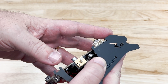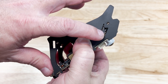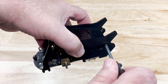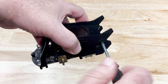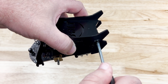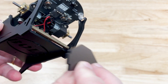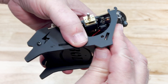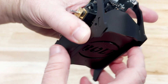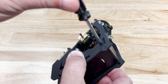Don't worry about the front yet. Do the same thing for the other side panel — again, just worry about that back tab, not the front. Attach the side panel only in the back with an M3 screw. Up next, we need to add the front plate. Make sure the tabs get into the slots. Then add the final M3 screw.